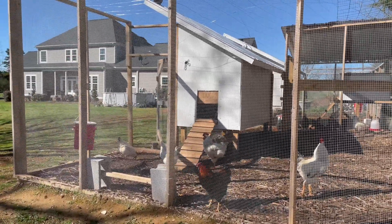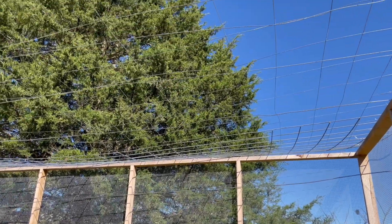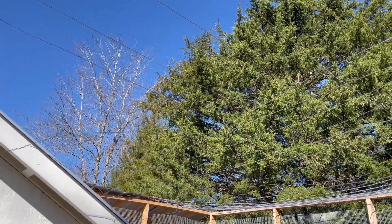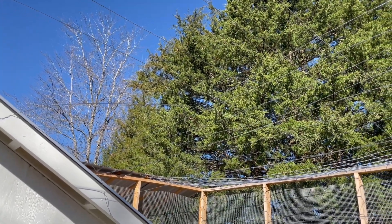On this side of the chicken coop the chickens have their door to get in and out, with a cute little ramp. After we built the walls of the run, the top was open. We could have used hardware cloth along the top but that would have meant putting braces up to support it. Instead, I simply took 14-gauge wire and strung it from one side to the other and then down to the far end, just to keep out any hawks or other predators.